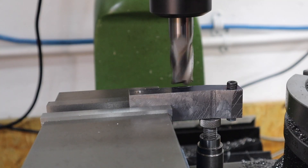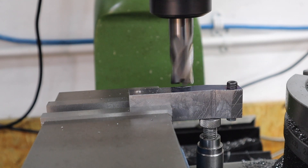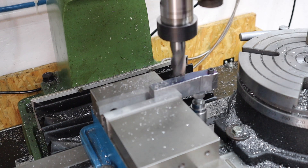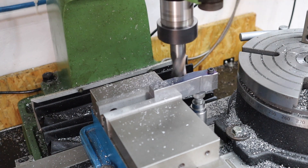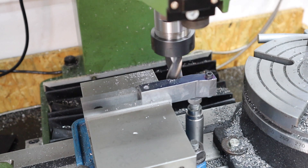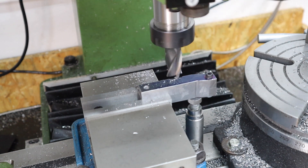The last procedure to get done while these pieces of stock are still bolted together is to get the half-lobe part machined out of the top. I thought it would be a good idea to do this by plunging in with a 20mm end mill - it started off pretty well but towards the end we got a lot of judder and chatter, so I sort of regret doing this, but that being said it still got the job done.